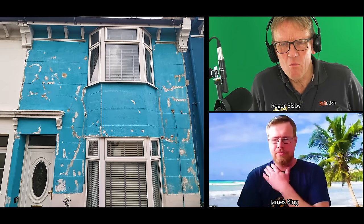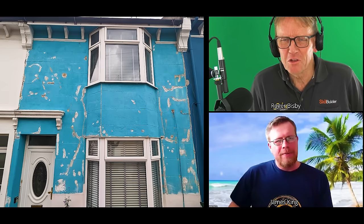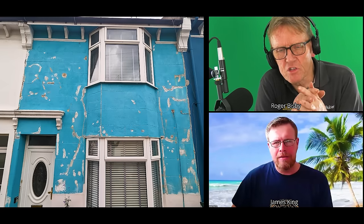There must be some form of damp barrier in there somewhere, whether they just didn't find it when replacing the brickwork. I just can't understand why it's been chopped. It almost seems like somebody thought they could make a bit more room in the house. Why would you chop away the brickwork going around the bay? It could have always been four inch — you do see single-skin brick bays, and they tend to sink quite a lot. But it's clearly not good — you'd definitely want a wider sill there.